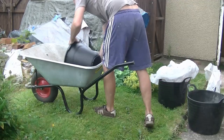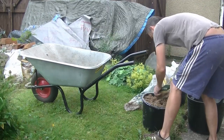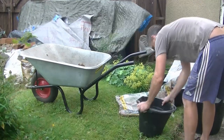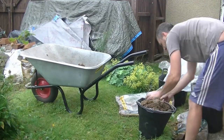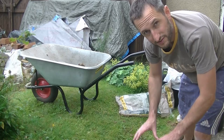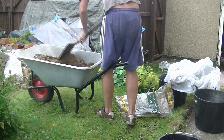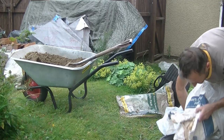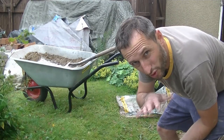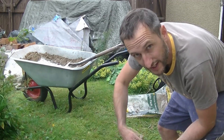So here we go — that's my cement. And because of the ratios, I can work out that because I used half a bucket of cement, I can just do two full buckets of sand. Finally, I just put a quarter of a bucket of lime. So that gives me the ratios. I'm going to mix this up dry now, get it all together, then we'll start to add the water and get it down to a nice, creamy, workable texture.